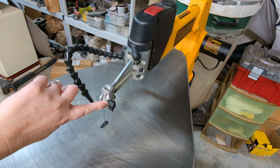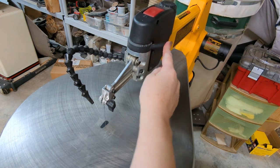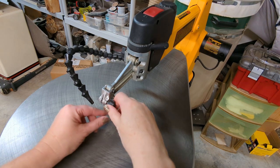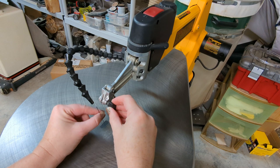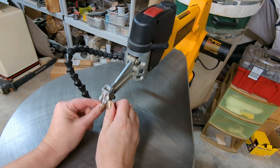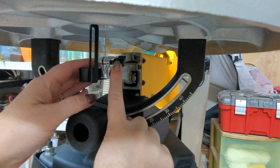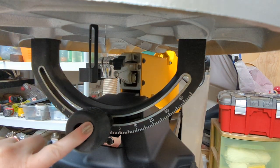This here is the screw to release the top of the blade. You want to make sure that if you are working with the blade, you have the tension all the way down and the machine unplugged — that's the safest way to do it. There's another screw like this that holds in the bottom of the blade underneath the table, and then this will control the angle of the table.